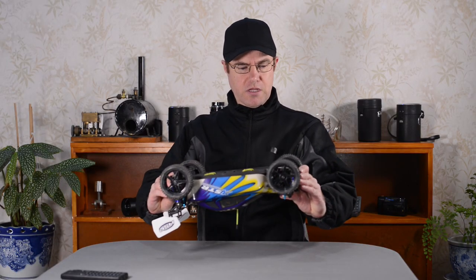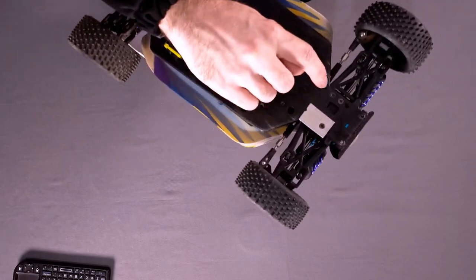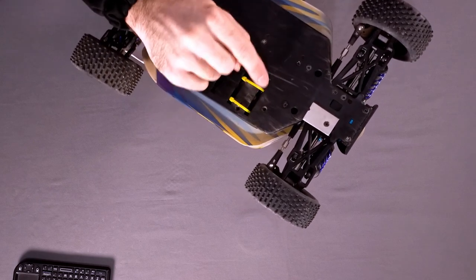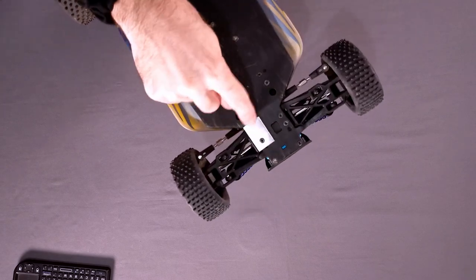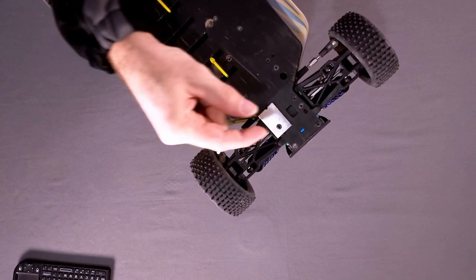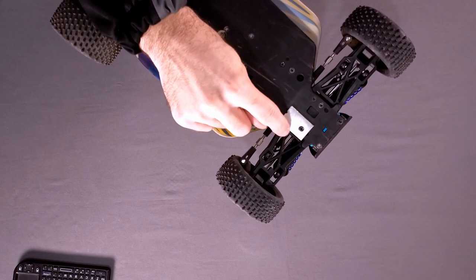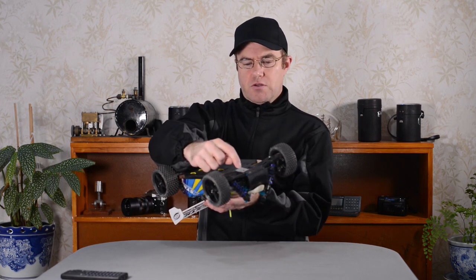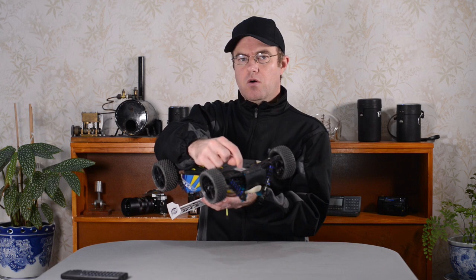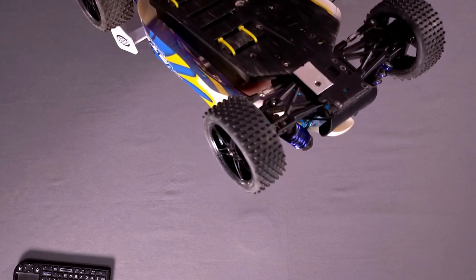What I'll do is show you the reason why I'm thinking of making a skid plate. Right about here we've got some gouges — not seriously deep, but we're getting some damage up here in the front. If you're wondering, that piece there is a test piece. I grabbed some of the stainless steel I want to make the skid plate from, just to see what the thickness is like. I've also drilled a countersunk hole for the stainless steel, and it seems to fit quite well.